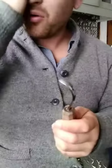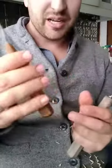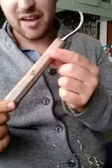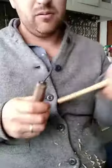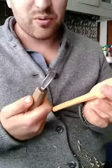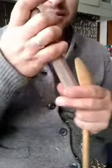So, there are also different ways that people hold hook knives. Your classic short hook knife, I think a lot of people tend to hold like this. I tend to choke up way more on it for two reasons. Number one is I get a lot more power, and number two is I find it safer. Because when the hook knife is totally closed in my hand, it still can't reach my thumb. Whereas if I'm back here, see how it gets me closer to my thumb. So the more choked up I am, the further away from my thumb I am. Now, hook knives like this that have a longer handle, you can also hold back like this and then use these fingers to support the cut. I find this super annoying and frustrating. I don't know why people do it. I still choke right up on this blade, and that gives me lots of power. So that's what you're gonna see me doing.